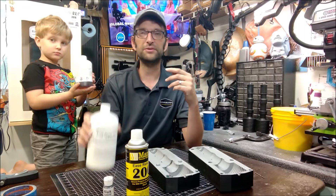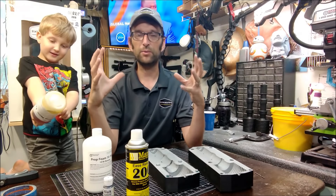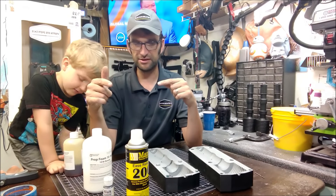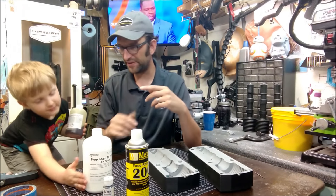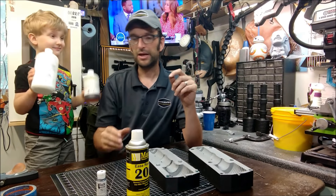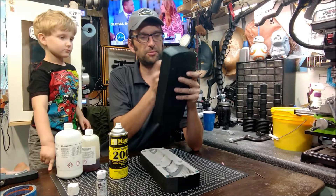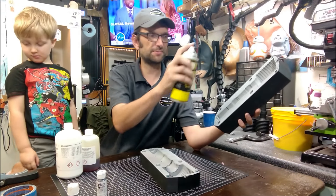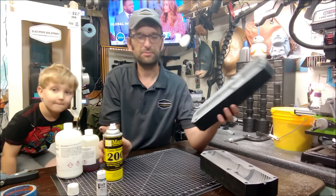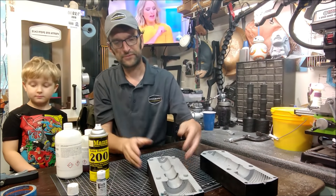This is a 10-pound density foam, meaning that for one cubic foot of finished material it will weigh 10 pounds. They also have a 2- or 4-pound density available as well. We needed some colorant for the urethane expanding foam, and then we also need some kind of release agent. The first step is we have to put release agent in there — we've already coated this really well previously — so that we have the mold prepped.